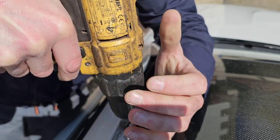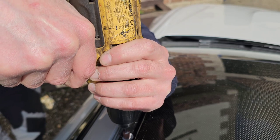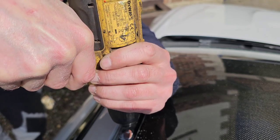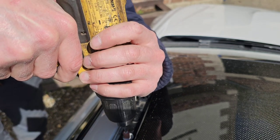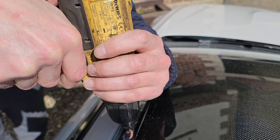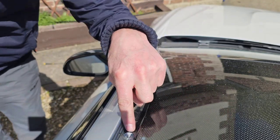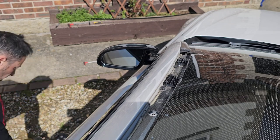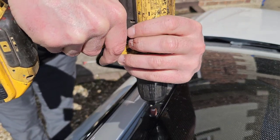What I've found in my garage is a little Dremel grinder bit - I'll just give it a little bit of a whirl to see how she goes. It's a little bit sketchy. I'm pretty much down to metal now - there's a little bit more to do at the edge. Now I've just got to get the bit out of the allen hole, which I'll do with the pick. I've dug the bond out of the hole for the Torx bit - I just want to give it a little bit of a widening.